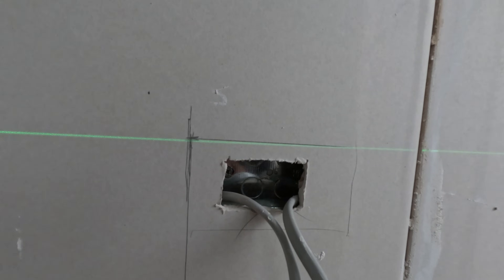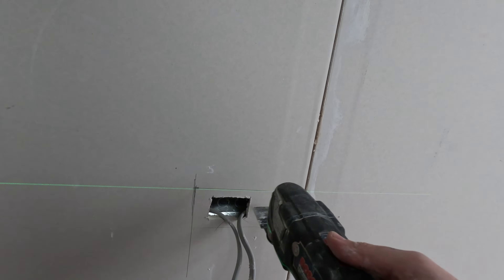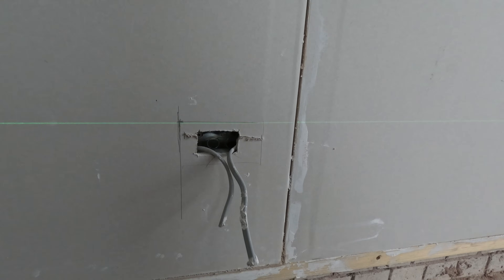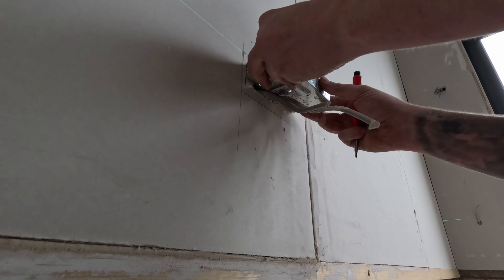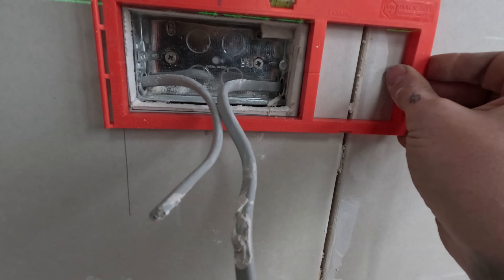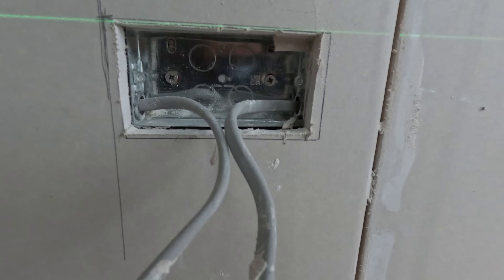This one is completely covered up. We've still got a laser for our height and it should be perfect because we lasered all these originally. We want to find where the box finishes and starts — with the multi-tool turned on, you've got no teeth on the side but it'll let you drag along until you hit it; do that both ways and you should be able to find it. So that's the edge of our box where this pencil mark is. We've got our height there so let's trust this. I'm just going to go within the lines — that one's kicking over way more than it should. Double-check I've hit that all the way across. That is now a perfectly cut out box.